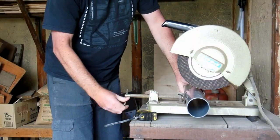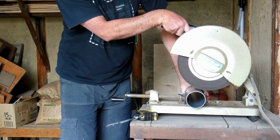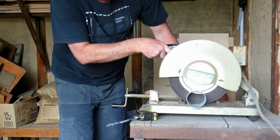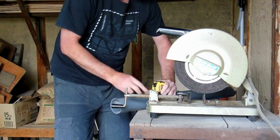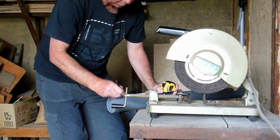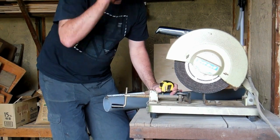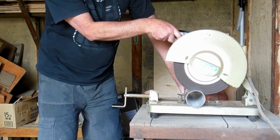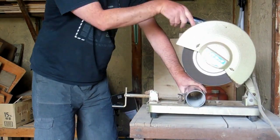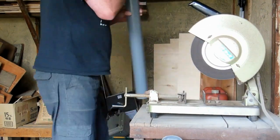So it sort of worked. The ventilation thing sort of worked and took away most of the mustiness. But just now and again, we'd still get a bit, and it was a bit annoying. So got the Unskilled Plumber to have another look at it and try to work out a solution. So we were wondering if we couldn't get a U-bend underneath the bath, if it was possible to put a U-bend where the pipe actually comes out into the drain, if that would work.